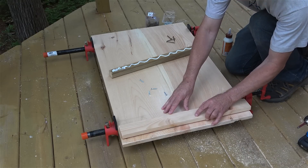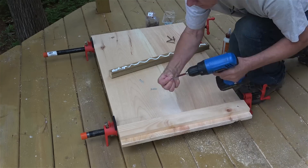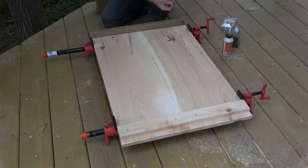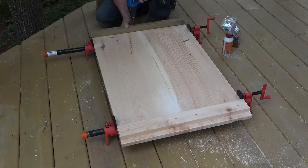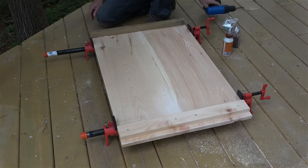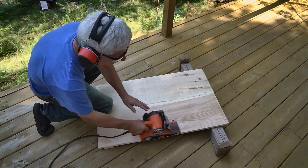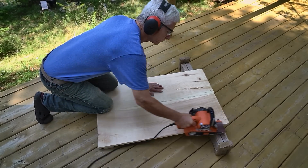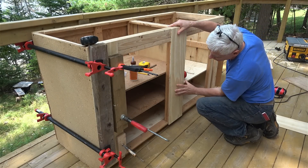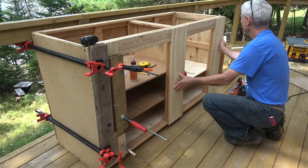The next part was building a side for the drawer section of the cabinet. Once the end piece was built I smoothed it out with a belt sander and 150-grit sandpaper. I was happy to find that I only needed a two-by-three foot piece of quarter-inch finished plywood to do all the trim in the front — I clamped and glued it in place without using nails.